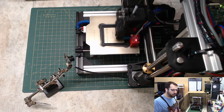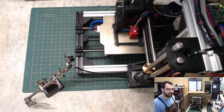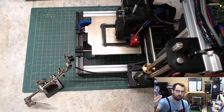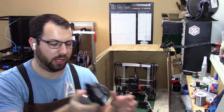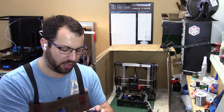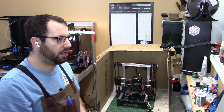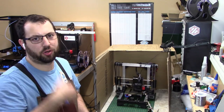But it's not super common because you kind of need more custom parts. I know a lot of people get MJF parts or whatnot. So it's a lot finickier, or not as simple to do at home. Like a Mobius 4, you could easily print all the parts you need to build this extruder on any printer that can print ABS decently. You do need some BMG gears and some belting and whatnot, but this is pretty much common printer parts. Whereas the Orbiter, because it's got the planetary gear, you need the funky helical gears, and printing those isn't as easy to get consistent results as purchasing MJF, so you have to purchase another item.